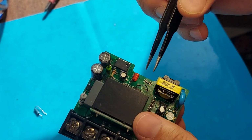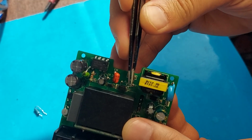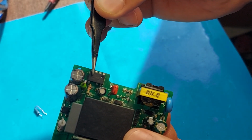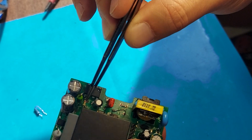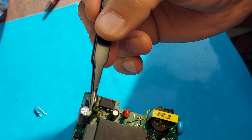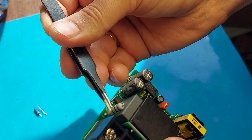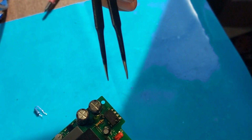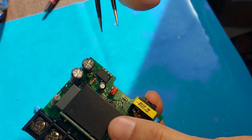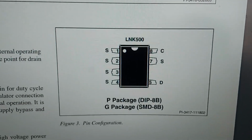The first is a thermal fuse. I made a jumper instead. You can buy it and install it. I showed it earlier. The second is a PWM controller. Third, this resistor called R18 with a rating of 1.2 kilo ohms burned out. Fourth, I changed 2 electrolytic capacitors. Fifth, the diode bridge burned out. Sixth, the input resistor burned out 3 times when I tried to start the device. Seventh, the contact from the input to the diode bridge was lost. And 8th, the track from the capacitor to the inductor burned out. And the small inductor burned out.